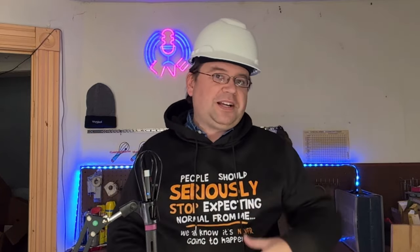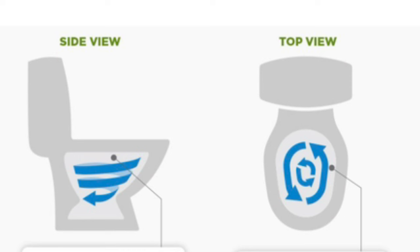The first cause is possibly a design flaw in the Emax or Gmax series flushing systems. Both of these flushing systems utilize a siphon jet at the bottom of the toilet to create a pull, or siphoning effect, and rim jets create a push to get the waste to go down the drain. However, the rim jets do not adequately clean the bowl — all they do is push things down. For their time they were innovative, but we have newer options that are better. This is something they addressed in newer flushing systems like the Tornado Flush, which utilizes rim jets that actually circle the bowl, giving you a much cleaner flush. Of course, being that it's an apartment, you would rely on your landlord to replace it, and if they do what most landlords do, they'll buy whatever's cheapest.